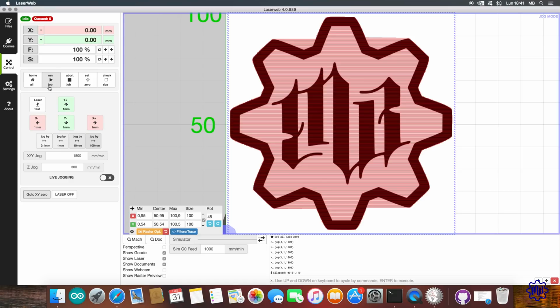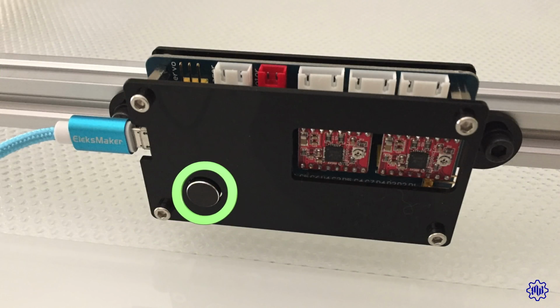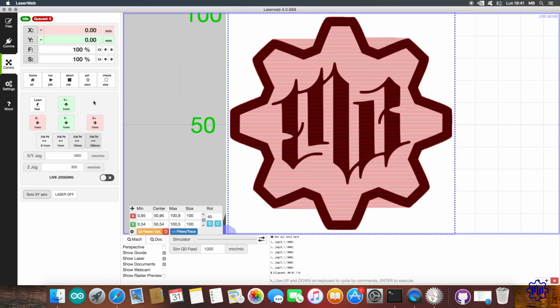The laser will then begin to engrave the selected area with the selected image. If something goes wrong, a click on Abort Work blocks the laser movements. The Start button also works as a pause, if you want to stop the engraving to cool the laser module, for example. In case of problems, however, act on the only button on the electronics board, which will remove the 12 volts applied to the laser itself. It may happen that something goes wrong, especially on the first engravings, so be ready to act on this last physical key if you need it.